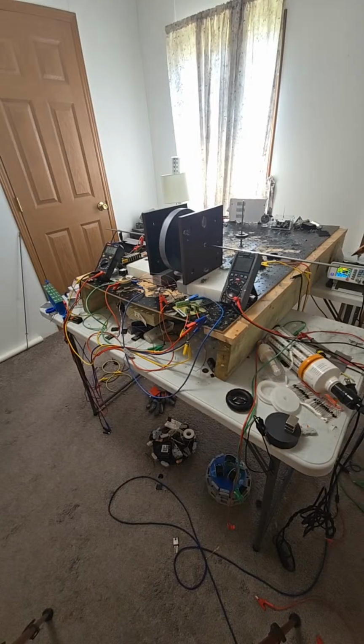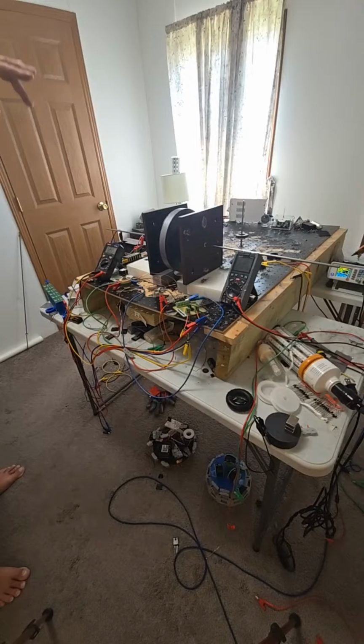First ask, hello guys, what are we trying to do? This is a closed loop system. The battery over here is running the pulse motor through the SSG, which is running a bifilar coil with 32 gauge trigger and a bifilar drive of a 20 and an 18 gauge. And then the output is connected to a cap bank, which is then connected to the battery that I'm using to run the whole thing.